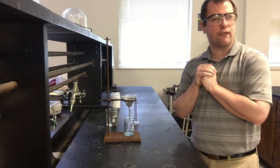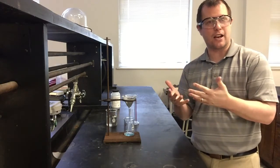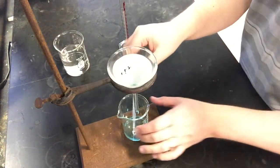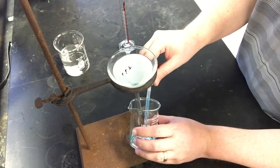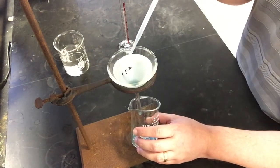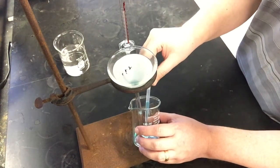We're just about done with our filtration here. I've been constantly cycling the sulfuric acid back over the few areas where I still have a little bit of black solid remaining, attempting to get all of it dissolved. We're not adding more sulfuric acid — we're just using the same 10 milliliters, constantly passing it back over the copper oxide solid. I'll show what the near-final product looks like and then the last step of how we get that copper back.